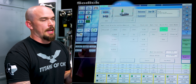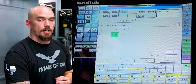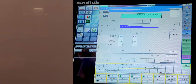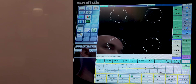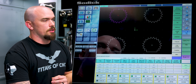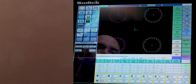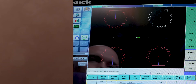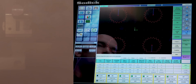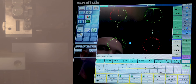After that, we fill out the rest of our parameters and go into our condition search. Here we want to use our S3 core conditions. We're going to select ten thousandths wire, using brass wire, with a workpiece of steel at 1.57 inches thick. We're going to go to die, S3 core nozzle position, and we're running three-pass technology for this program, so we select that and hit OK. Now all we need to do is select our pockets — select the pocket, select the thread point, and select the entry position for each pocket. At this point our program is done. Activating our slug puller is that easy.